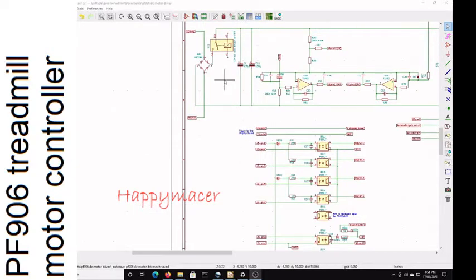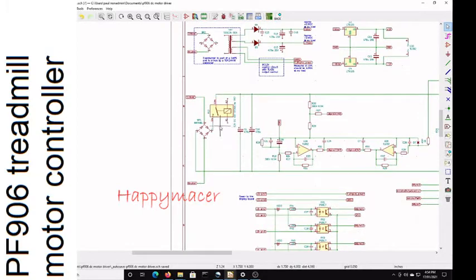Going back to this relay: as you can see it's in the DC circuit, so every time it turns on it would see the full inrush current of the two smoothing capacitors, which is probably significant. I'm not surprised that the contacts burn after a while — it probably isn't rated for that, or isn't the best quality. There might be better ways of connecting it to prevent that inrush.